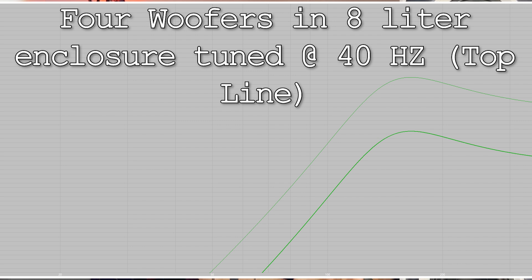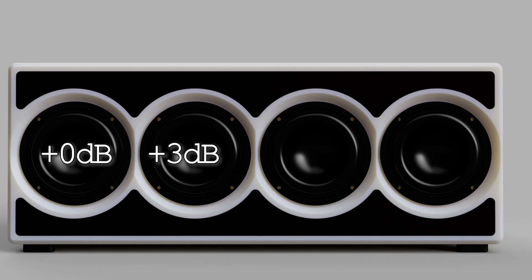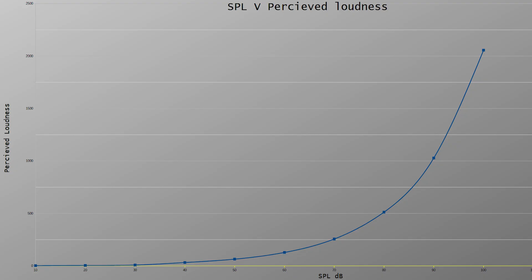When you start stacking speakers, you get a plus 3 dB boost in effective sound for every speaker added. Adding three extra speakers gave me a 9 dB increase over one, which is roughly equivalent to double the sound output — since 10 dB is equivalent to about twice as loud to human hearing. So you can effectively double the output just by adding speakers.